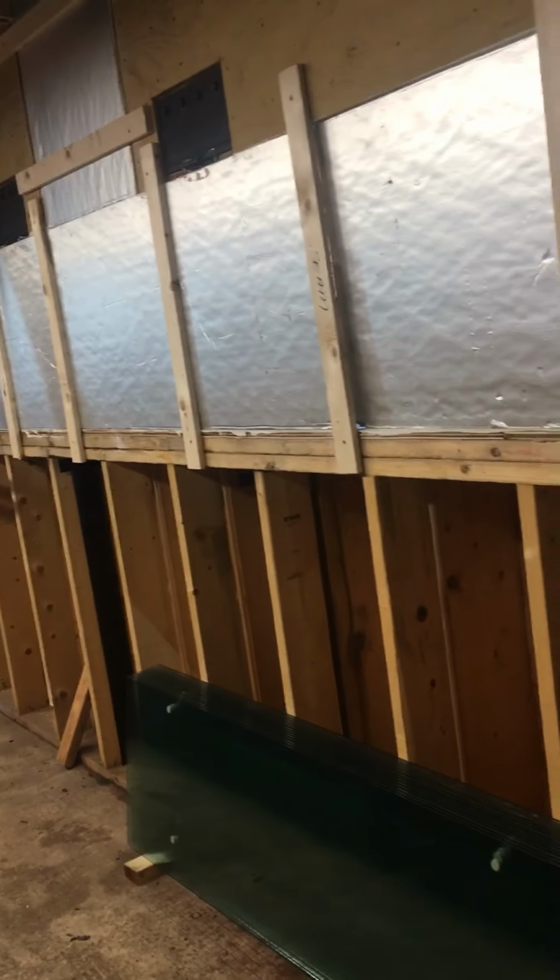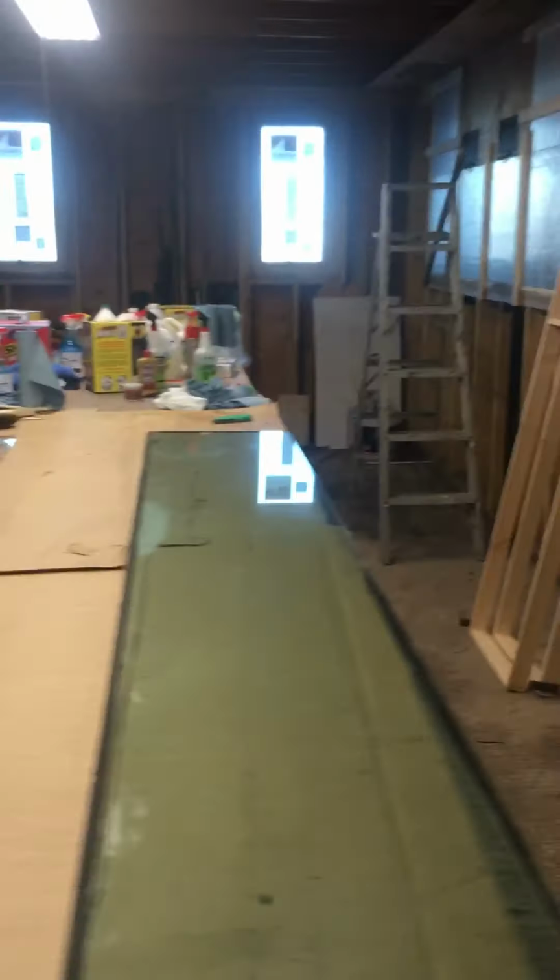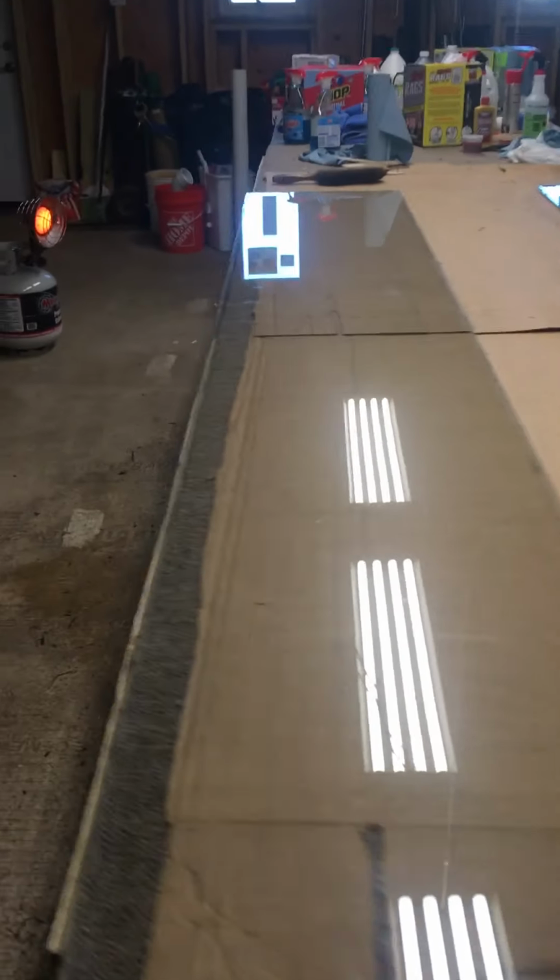So it's a tempered glass. It's called a solar temp, and that makes it difficult for us. I mean, it makes it good for us because it makes the glass that much stronger, but it makes it harder for us to cut, and we do have some cuts where the glass ends there and it ends over here. We got to make some cuts, and then when them verticals go up to meet the top, there's some cuts. So that should be interesting.